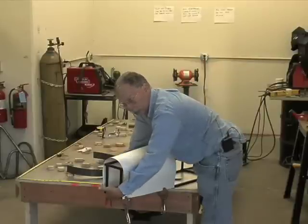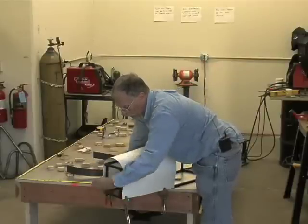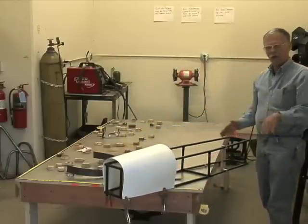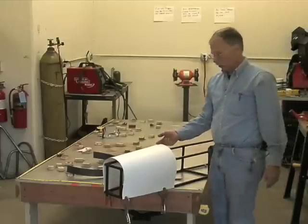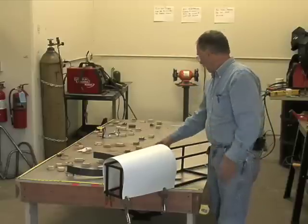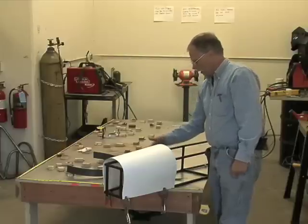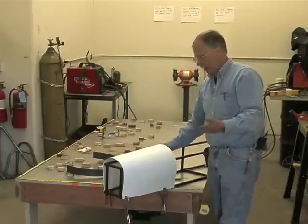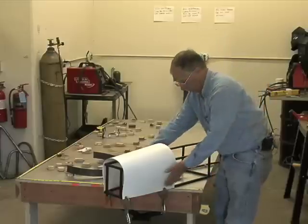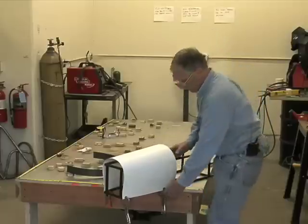Now you'll have to create a nose cone out of fiberglass or metal or something else that will create a nose, but you can carry this all the way down the length of the car very quickly, very simply, out of straight sheet metal. You use poster board to lay it out and make templates, because metal like this, 1 millimeter metal on this table, that's $100 worth of metal. A skin covering that's 0.025 inches thick would cost about $60. If you make a miscut, you've thrown $60 away. If you make a miscut on poster board, you've thrown $1 away. So work it out in poster board.